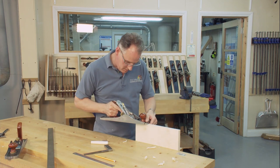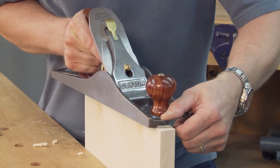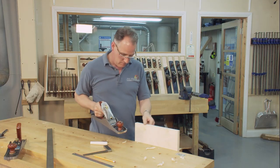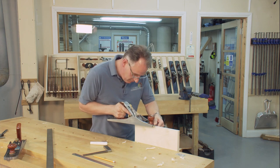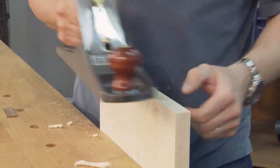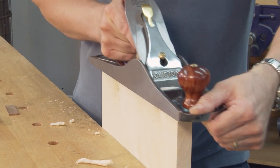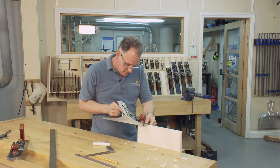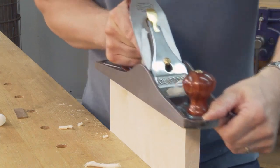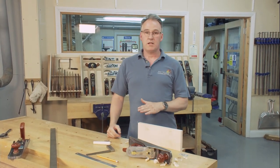Taken off that pencil line — not off the middle, just found that one. The plane is pretty sharp because it's actually only taking off the high spots that I'm looking to take off. That's good news. That's probably brought it back into square. I'll do some cuts all the way along the left edge, the middle edge, and over the right-hand edge. The other thing to check for now is what's it like for straight.